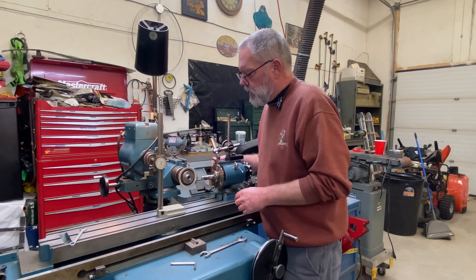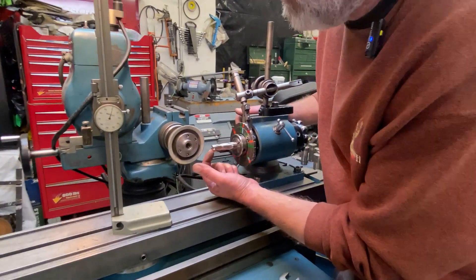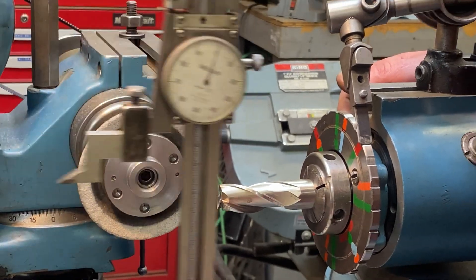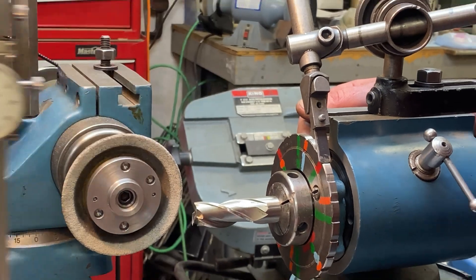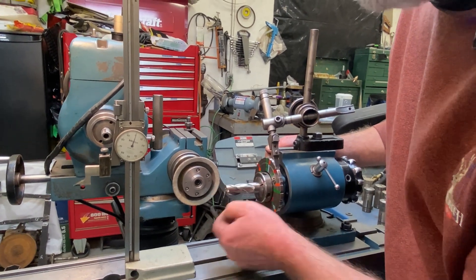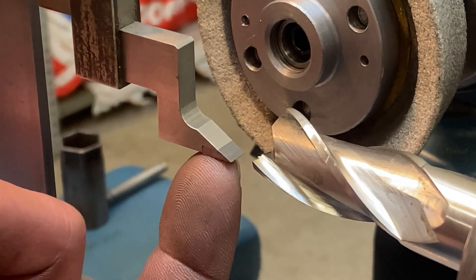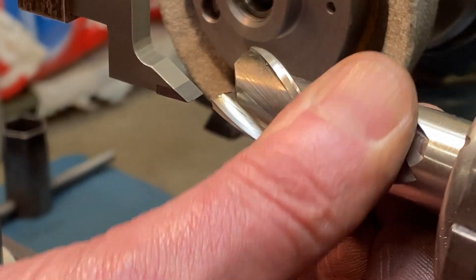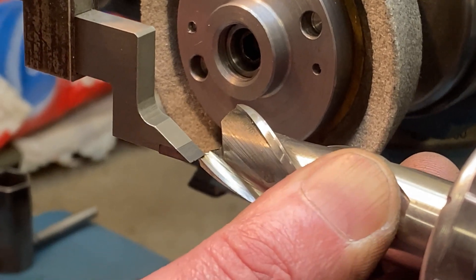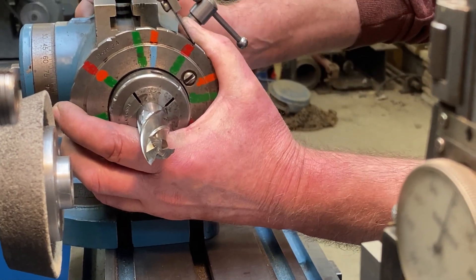The next step is I need to get the very corner of a tooth perfectly vertical over the little point we've left in the middle. I can measure height with this height gauge — you pretty much need one of these to do this kind of work — but there's no way to measure rotation other than by using height. So I'm going to get this tooth face on center and then back it up until it's in the vertical position. I have my height gauge set at exactly center height, and the tool is loose but snug in the collet, so I'm going to rotate it up until it just touches.